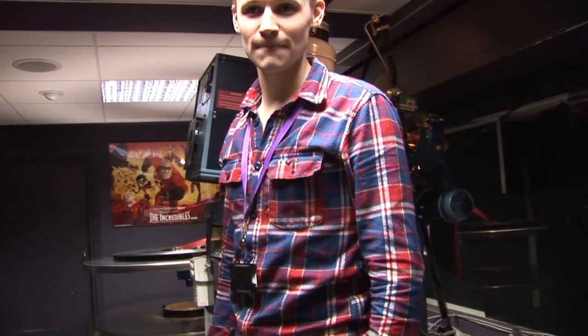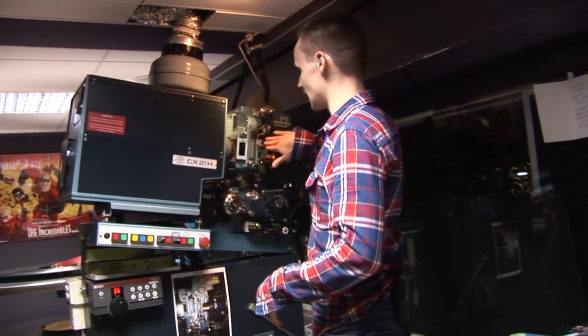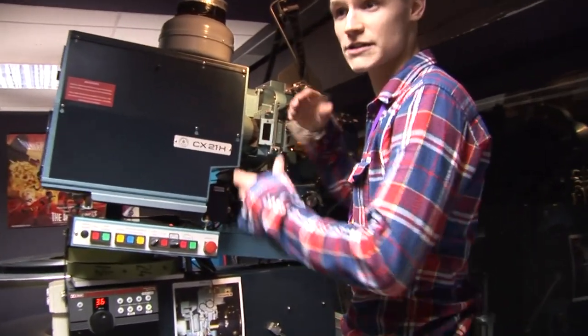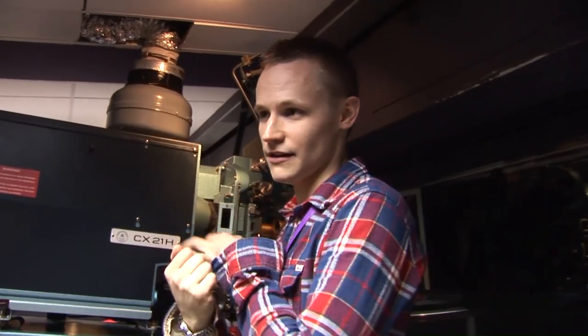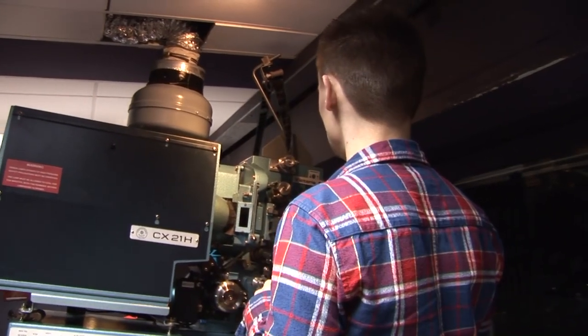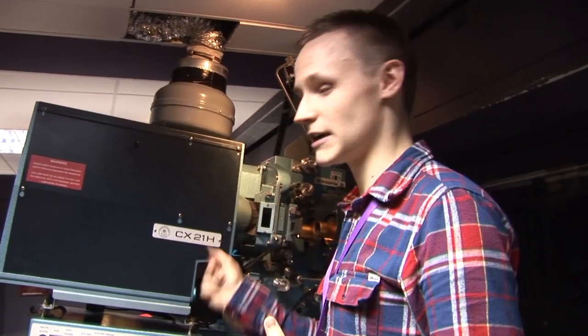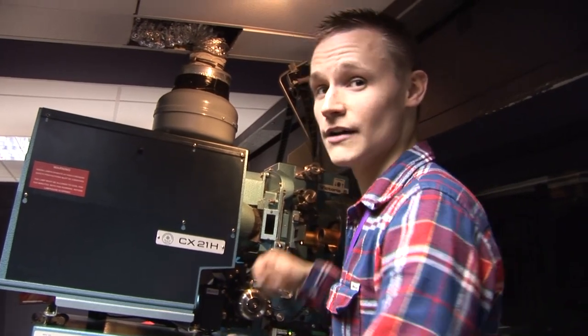And when you've spliced the film, registered it together, if one of those was to break, could you sort that out? Film snaps are fine. We don't mind film snaps because they're fixable, as I was just saying. If a film snaps, and inevitably a film will snap in this area where the gate is because something will have snagged, there will be a dodgy sprocket that will have just caught. And again, because the tension sensors are so clever, it will cut the whole thing out. It knows there's a problem. So it will kill the lamp, it will set the house lights up. Oh, right. Yeah, it does everything.